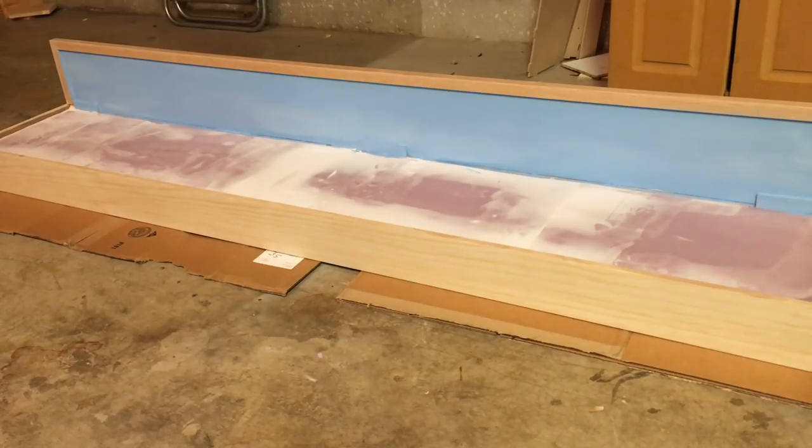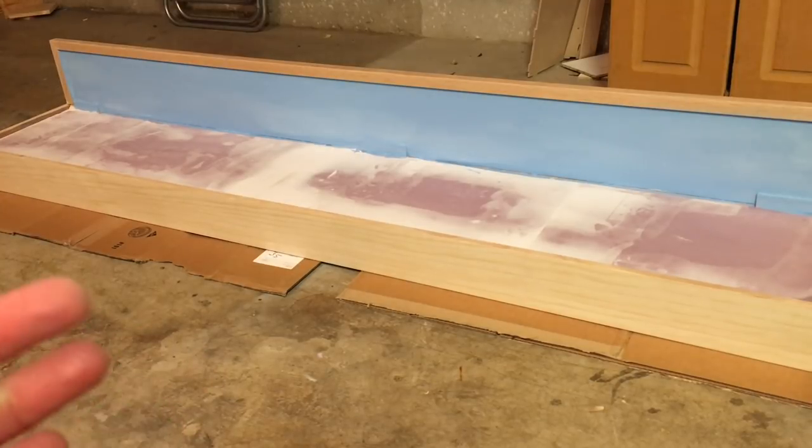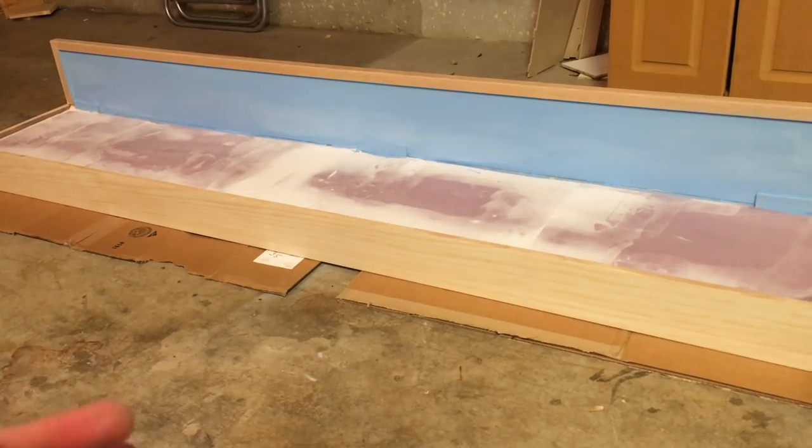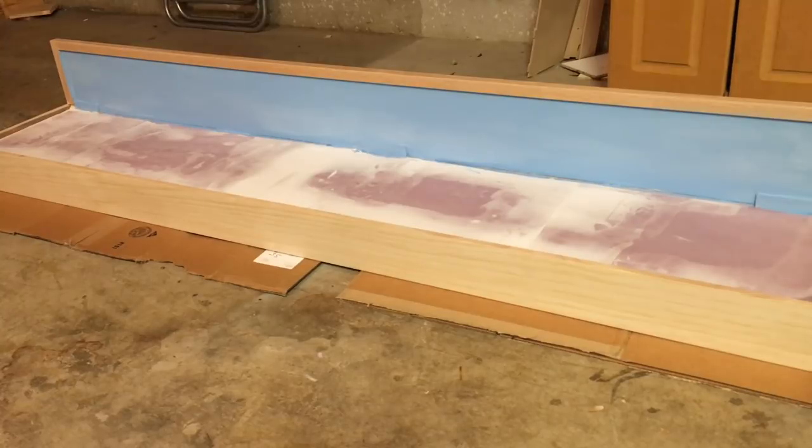the scenic cement, that kind of thing. And if you get a whole bunch of that on the wood, it's going to absorb into the wood and prevent it from taking the stain very well. And so I'm going to get a coat of stain on there now. Once everything is done, I can sand it and reapply more stain afterwards. But because there will at least be a base coat of stain, the final product should look a lot better.